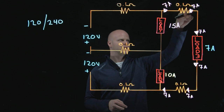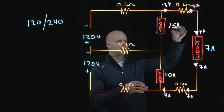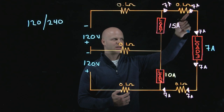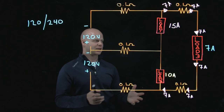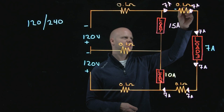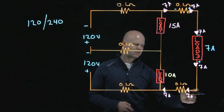If this is an electrical circuit, this could be a resistor — maybe we have a breadboard circuit, a little circuit board, or a full electrical circuit. This conductor has a small opposition — 0.1 ohms — so I'm using the same conductor throughout this entire circuit. Using electron flow — negative to positive — if current is flowing negative to positive, then this has to be a negative as it's flowing through. I would have a collection of electrons there and a deficiency at that point. Current flowing through the load means I have a negative at this point and a positive at that point. As I continue, I will have a negative and a positive.